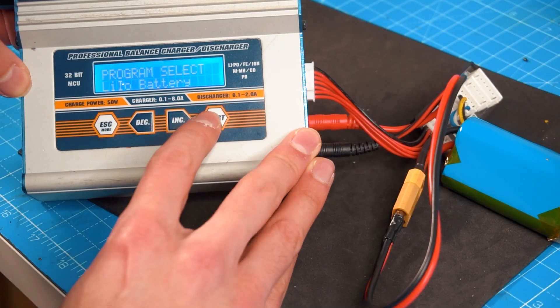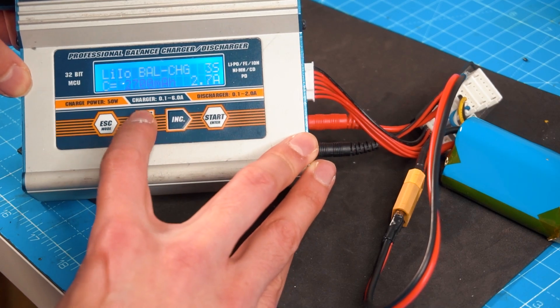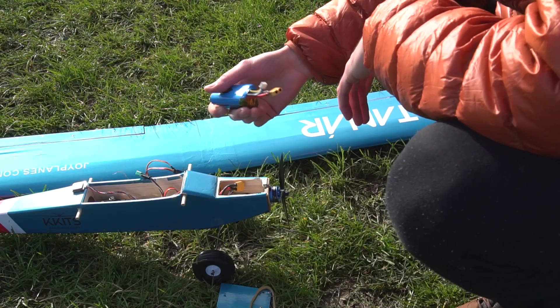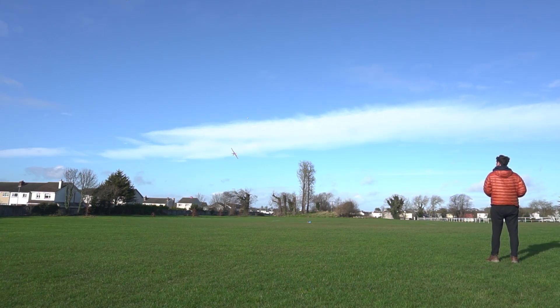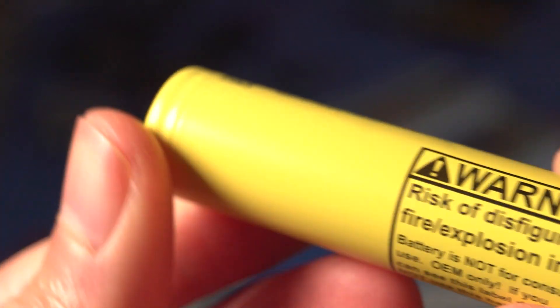Because the lithium-ion battery has each cell at a lower voltage than a LiPo, you have to use the lithium-ion program on the charger to handle those lower voltages. So there you have it — the LiPo batteries are the winner in terms of power delivery, though that depends on your application. If you need a very fast, aggressive racing drone you'll use LiPo batteries, which give you the most power in the least amount of time. Remember to subscribe and I'll see you in the next project!